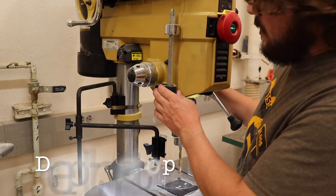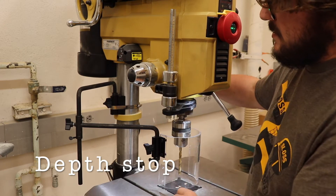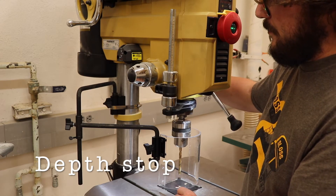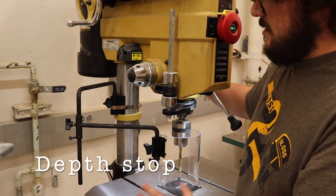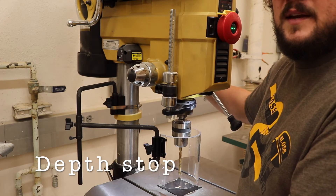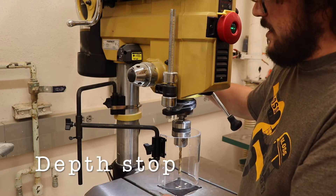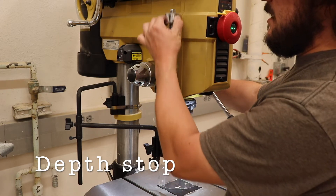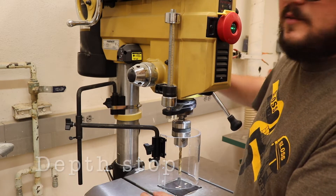This component of the drill press is called the stop. If I press in the button, I can bring it down and make it so that my drill press stops at a certain depth every time I drill a hole. I can also spin the stop to adjust it in a much finer fashion and really dial it into a specific depth. This is very useful when using the Forstner bit and trying to drill a hole with a flat bottom repeatedly. If you find that the drill will not go as deep as you wish, check and make sure your stop is not engaged — slide it all the way up to the top and that will allow a bigger range of travel.